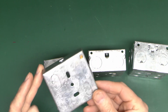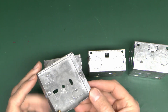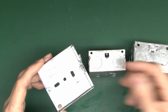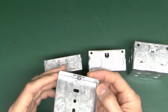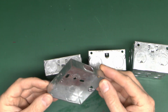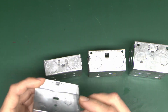Although you can buy 16mm boxes, I would not recommend using them unless it's absolutely necessary and you know full well that the only thing ever going to be put there is just a standard light switch, and nobody is ever going to want to change it to a dimmer or flat plate thing. They were fairly common at one time because people didn't have dimmers, but these days they're a bit of a disaster in terms of depth.